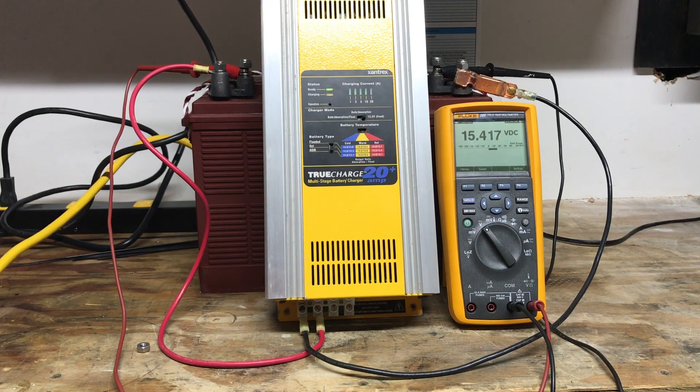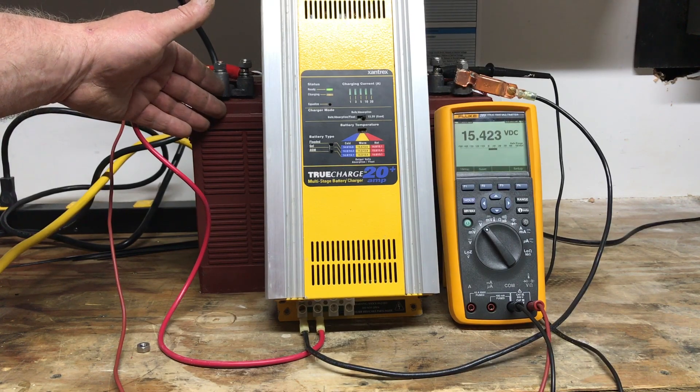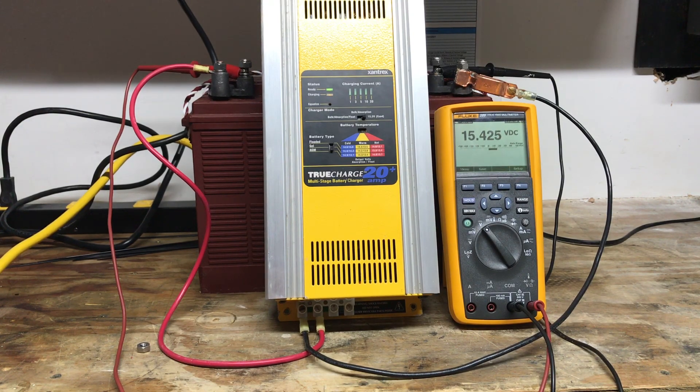Please be careful with unattended charging. If you're storing batteries on the hard in the winter, the safest and most practical approach is to charge the batteries to 100% in the fall. If they're flooded or Lifeline batteries that you can equalize, equalize them. Then 100% isolate them from the vessel — meaning disconnect them — and if they're in parallel, disconnect them from each other. Because one battery could have a slow leak in the separator, or a bad cell, and that can drag the whole bank down. So if one battery does go bad over the winter, at least we're not killing all of them.